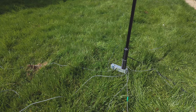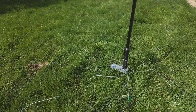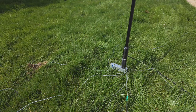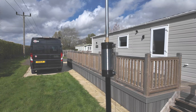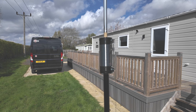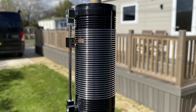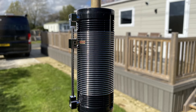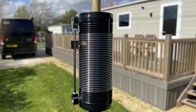This is an example where the common mode current on the outside of the coax works well for you because it acts as an extra radial. You'll see at the base of the antenna I've got this aluminium bracket — I've got two sets of radials on. I've got one set which clamps beneath the base unit as it meets that angle bracket, and then another set of radials which are actually attached to the bracket. I tend to have no more than three or four radials in a bunch otherwise it gets really tangled, and then attach them in sets of four. I'll add another set so I'll have something like 12 radials three meters long. Resonance is easily achieved with the adjustable shorting bar on the coil — one click either way makes a significant difference. On 20 meters one click will move you something like about 200 kilohertz, so fine tuning is done by simply telescoping the antenna in the appropriate direction.